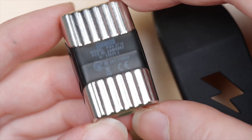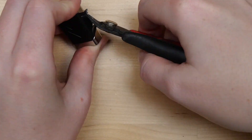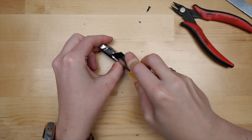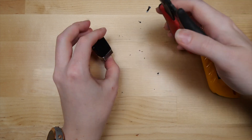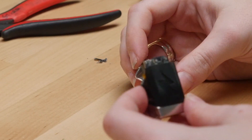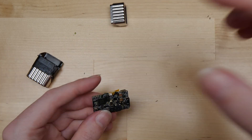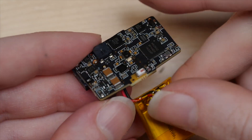Anyway, let's take it apart. I started cutting the plastic around the little metal nubs. The tricky thing about taking this thing apart, at least before the batteries died, is that it's easy to shock yourself while holding it in place — it's so small that one of the only flat surfaces by which to grip it is also the activation button. So I had to use the phone to make sure it was on a low setting and try to avoid pinching it while cracking open the plastic. After mangling the plastic near the nubs, one of the metal pieces came right out, exposing the circuit board inside. This enclosure design is pretty neat — the electrodes are also the case, which makes for a straightforward three-piece design. I was also able to put this one back together again, which is a rare occurrence in one of my teardowns.